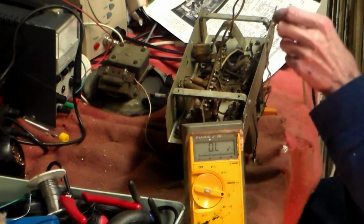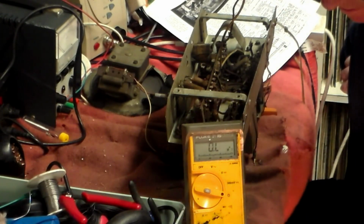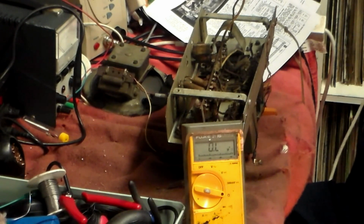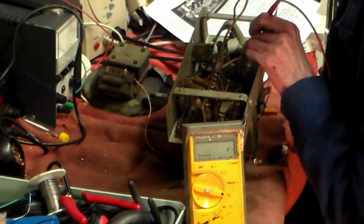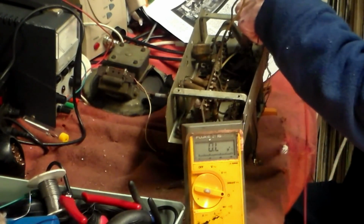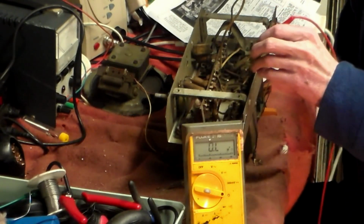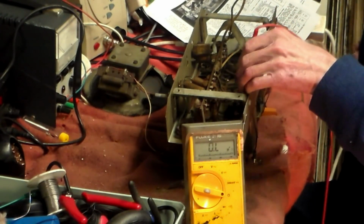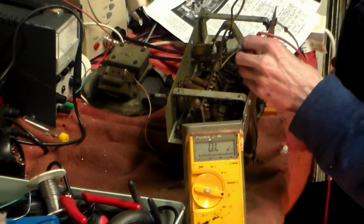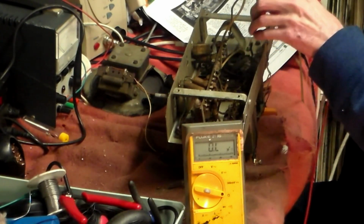So now we've got to sort out which one is which here. We do this, there are various ways of doing it. One is to switch it on and see where the power comes out, and not recommended. So coming out from here, there are 3 wires to this hole here in the circuit. And the red one goes to 2 or 3 different valve bases. That's obviously going to be the LT for the valve heater, so you know it's not that one, okay.